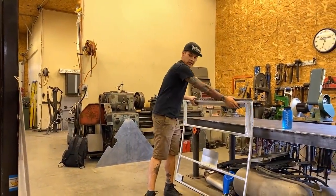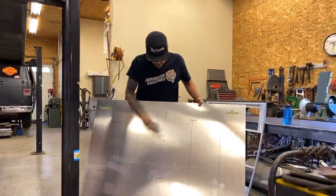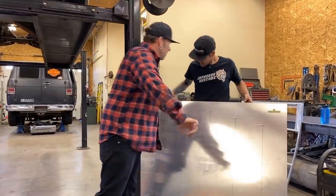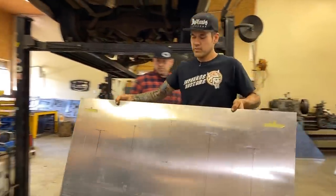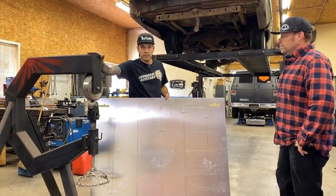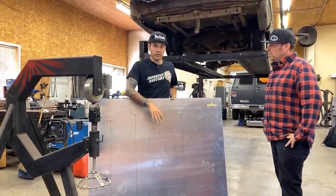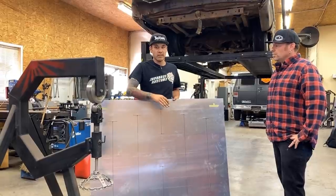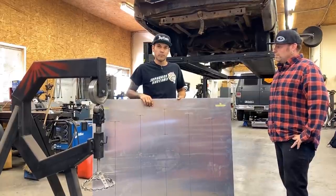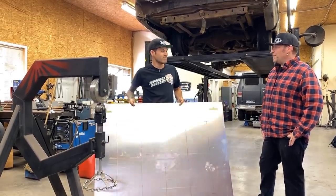This panel is what we're going to be bead rolling today. He's set out a bunch of different bead rolls — that's the license plate area with two handles. What we're going to do is pre-stretch these areas with the English wheel. When we make that bead it pushes up and stretches the metal, so we need a little extra metal there to get a nice bead without warping the panel. This is pretty thick — 0.060 aluminum. Let's get started, it's only metal.